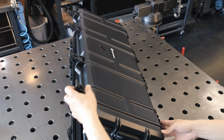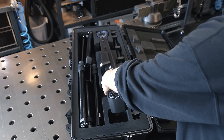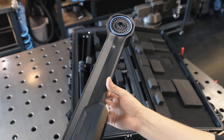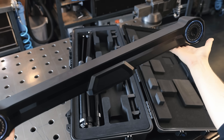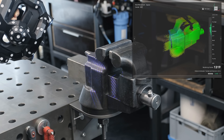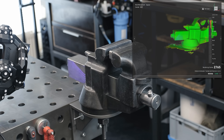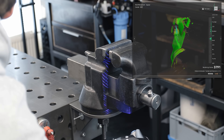The Trackit solves all these issues by not requiring any markers at all, and the reason why that works is inside of the second box. The device in here is called the Tracker, and it's basically an additional sensor with two cameras that you set up to overlook the general area you're scanning in. Instead of the scanner tracking the object, the tracker will actually track the scanner and communicate its position, so they've basically distributed the scanning and tracking to two separate devices. The huge benefit of this system is that it not only allows you to scan without any markers on the object, but it also results in much better tracking performance overall, which is why this solution is usually the standard on professional scanners that can easily cost 10 times as much.